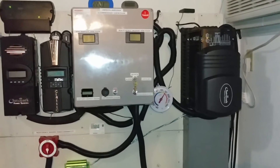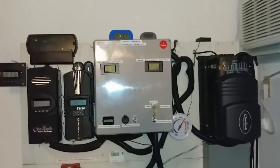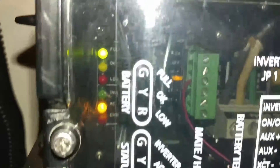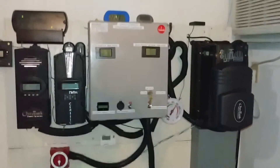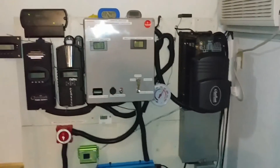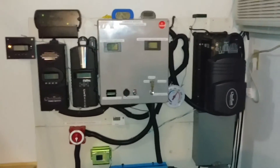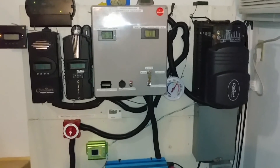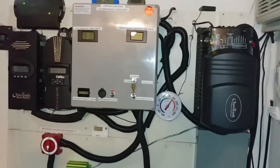It's normal. I never heard it, I know it's there. When I installed it I saw the fan and it is supposed to be connected to the aux — and it's there. The amber light will turn on if the turbo fan kicks in, and that's exactly what it's doing. By doing this I know the system is working. In the future if something happens I won't say the inverter blew up because tech support will ask me: did the turbo fan kick in? Well now today the system has already proved itself by telling me, 'Hey, I'm here and I can do the job and I'm working.'